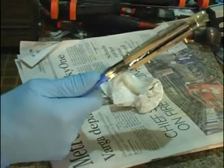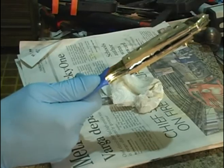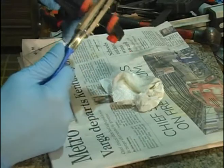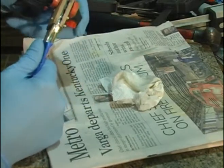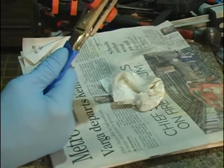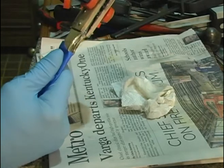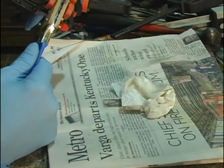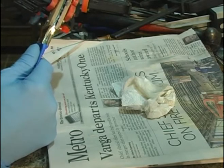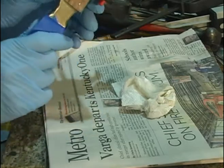And although it's not necessary in this case, really, because it's pinned down pretty darn snug, but I'm going to put a couple of clamps on it anyway just to help it along a little bit. You don't really want to use a whole lot of pressure, because just like using too much epoxy is a deterrent, putting too much pressure on it can also be a deterrent, because you're actually squeezing the epoxy out of where it needs to be.